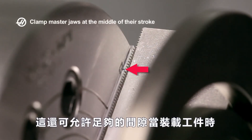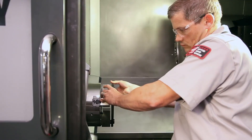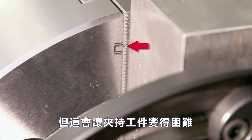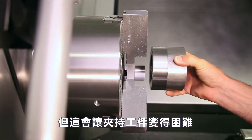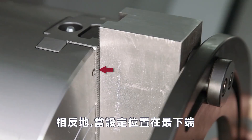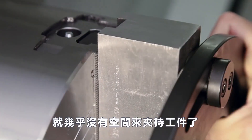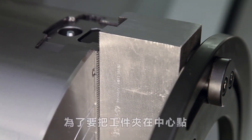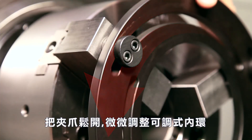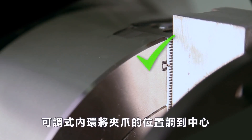This also allows for adequate clearance when loading parts and for variations in workpiece size when the jaws are used later in production. On Andrew's initial ring placement, we see that he is clamped at the very top of travel. Machining the jaws at this high stroke position would make part loading very difficult, since the jaws would only open a fraction larger than the part size. Conversely, if Andrew were to machine the jaws at a low stroke position, the result would be jaws with very little travel remaining to grip the part past the nominal diameter. In order to clamp at the desired center of stroke, Andrew unclamps the jaws and rotates the boring ring body slightly counter-clockwise to bring the adjustable dowels inward. The boring ring is now clamped at the center of the stroke.